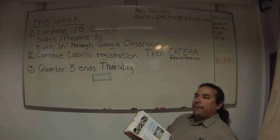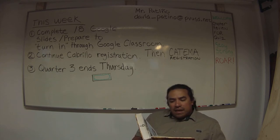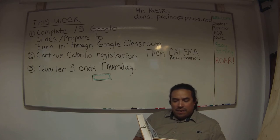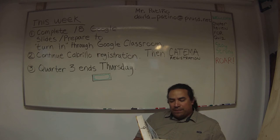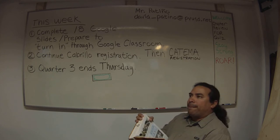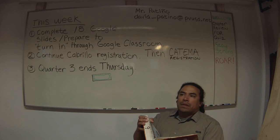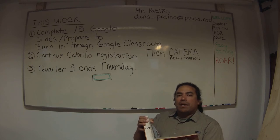What we are using in the scale model house project are brad nails. The nail size unit is called a penny, abbreviated with the lowercase letter D, and it indicates the length of the nail. A 2D or 2 penny nail is 1 inch long; a 6D or 6 penny nail is 2 inches long. This applies to common, box, casing, and finishing nails. Brads and small box nails are specified by their actual length and gauge number. We are using 18 gauge brad nails in lengths of 5/8 inch and 1 inch, which hold our scale model house together quite well.